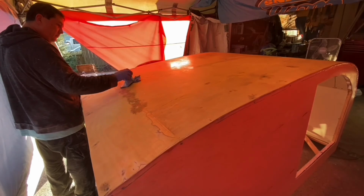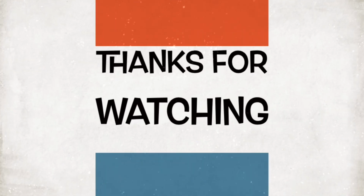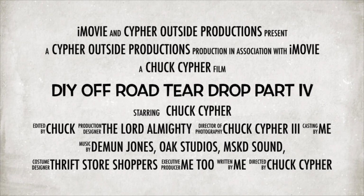The biggest trick is saturation. That material's got to be totally saturated. There can't be any air bubbles in it at all. Just squish them and push them out. Get all the air out. Make sure that the gap is completely full of fiber. And make sure that once that epoxy's in there, it's in there nice and tight, where it's not wanting to just drip out and fall out and cause another divot. You got to think about gravity.